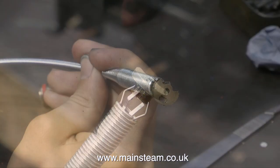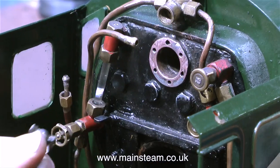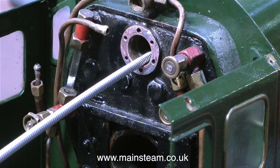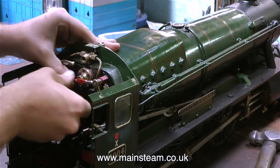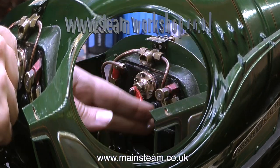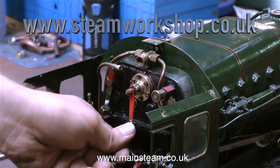Phil had a great deal of patience — this was a very fiddly job. Here's the valve: it's very tiny and fits right down inside a tube, and it needs lapping. He's using a special tool to lap it to the port face, and the entire job took about three and a half hours. It was difficult getting the fitting out to start with, and by the state of it someone in the past had used a screwdriver to lever it out. John expertly re-machined it and, as you can see, it's just like a new fitting. After Phil fitted the gasket and put all the screws back in, it was time to refit the regulator arm — which was difficult to the end, as the arm would not go on the shaft. We just tapped it on very gently, and once Phil fitted the nut on the end, the job was finished. It just remains to be seen whether it was successful. And that's it from me for the moment — thanks for watching, and I hope you found it useful.